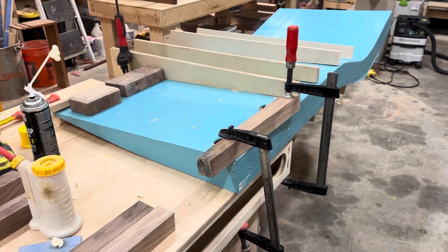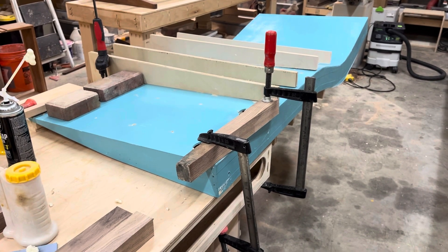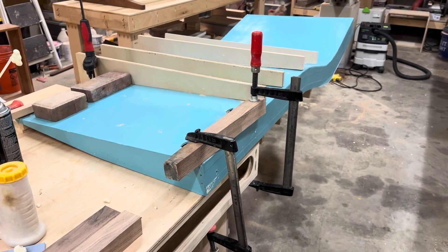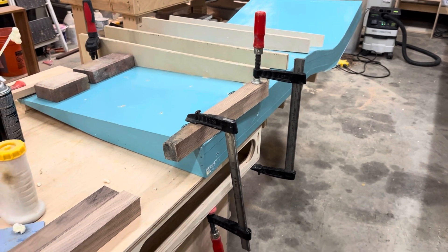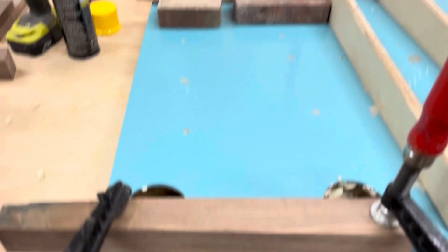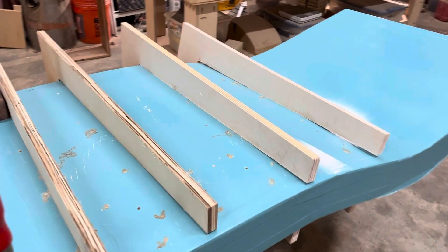Since we're on to calculations and trying to figure out what's going to break next, I realized if I do ever get up to 14 or 15 knots, the weight on the wingtip could be quite high — I think it was like 500 pounds or something. So what I did was I clamped the wing to my workbench and I was lifting up on it, and I noticed how flexible it was.